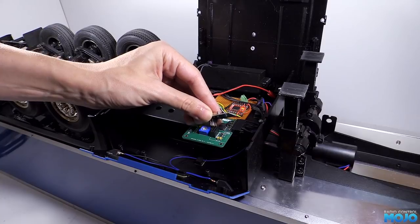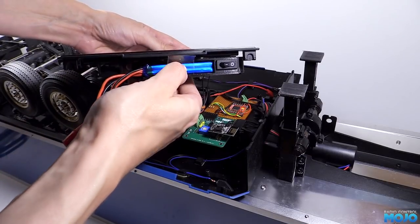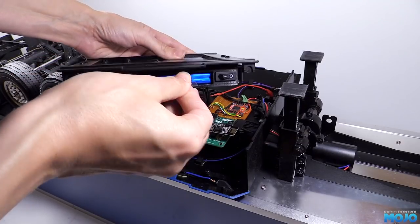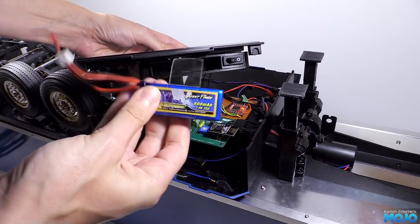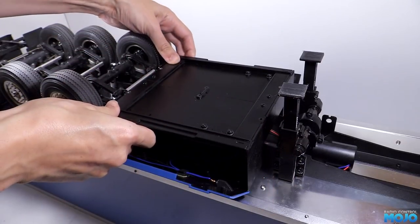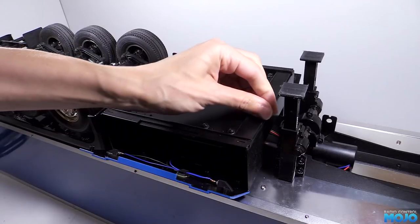That just leaves the battery holder, which is 3D printed of course, which is just stuck to the base with some servo tape. This 800mAh 2S LiPo is quite a snug fit, but once it's installed it's not going to go anywhere. There's also a switch mounted that disconnects the battery so you don't have to keep fishing out the plug. Right now, all the bits in the trailer are very much experimental. The green board isn't really a nice layout to fit in the box, and some of the trailers without the big box would be a bit of a pain to fit, but it is fully functional.